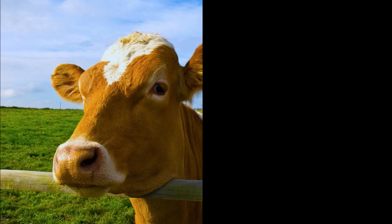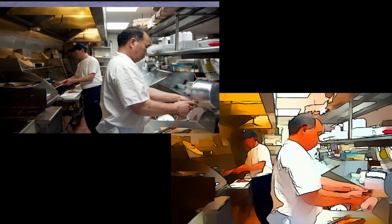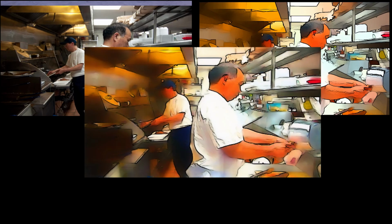Problem 2, realistic colors and textures bother me. Now that I have an augmented reality app that works on my phone, I just need to add some image processing on my phone app. OpenCV has this function called stylization that simplifies similar colors together and highlights the edges, giving the image a painter's look. If we take that output and add some color saturation, the image begins to become something that my eyes can stand looking at. To get this working on a phone, I proceed to throw away all that code in OpenCV and train a neural network to imitate the effect.